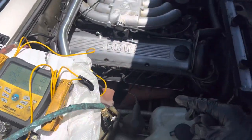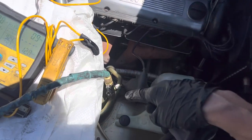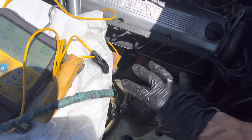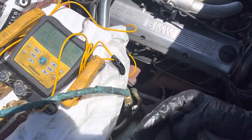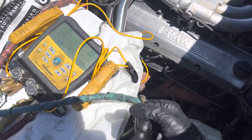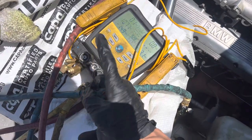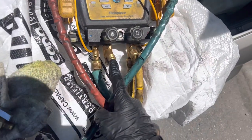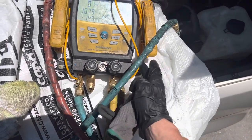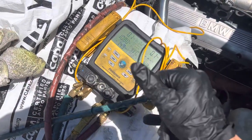On this vehicle I'm going to jump into a high-pressure nitrogen test since there's no refrigerant in here. I'm going to throw it on the vacuum pump first because if there's moisture in the system or any other refrigerant, I don't want to push it under 150–175 PSI of dry nitrogen deeper into the oil and system. I want to do a quick evacuation with a vacuum pump, see how low I can hold under vacuum, then put nitrogen pressure in — around 100 PSI. This is video number one. With the vacuum pump hooked up on port two, I'll turn off the vacuum and then immediately open nitrogen on port three using the four-port manifold, so you can do more than one thing at a time without switching hoses. Next video: vacuum and nitrogen pressure test.